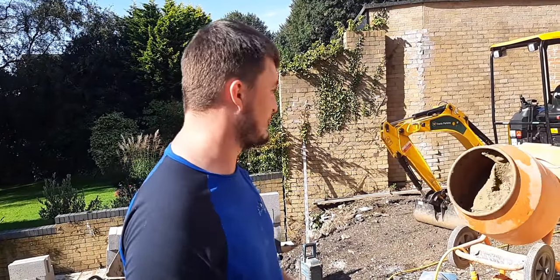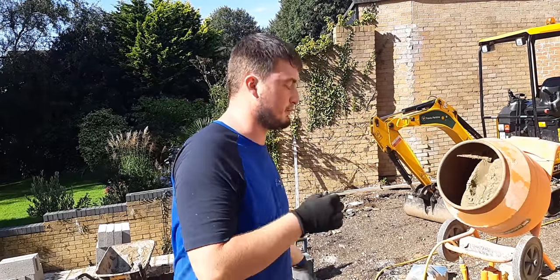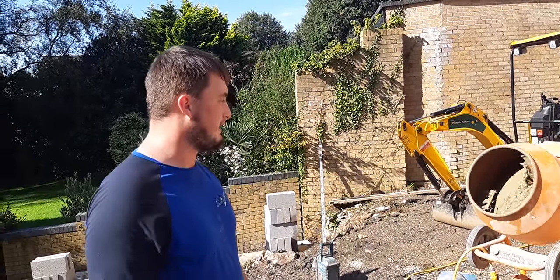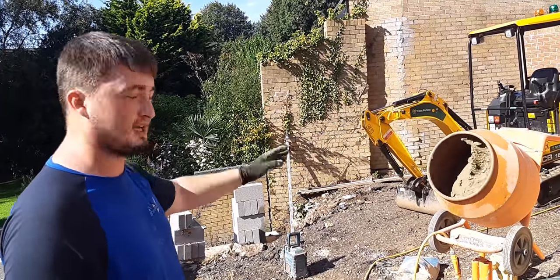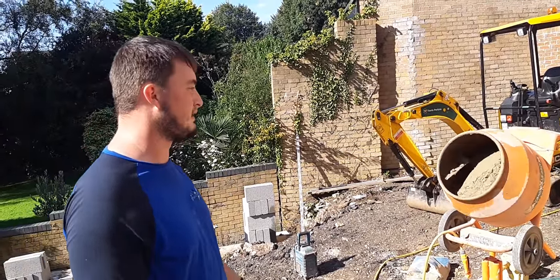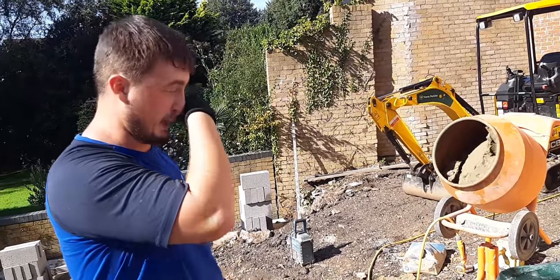So if it's too wet, and you think, oh wait, that's really wet sand — let the sand in first, let it mix on its own, and if you then see you need to grab water, there's nothing wrong with that. I've made the mistake of adding the water first when I've got really wet sand, and it's unusable. We've got to tip it in the bin and the boss ain't happy, because you're wasting the sand he supplied us with.